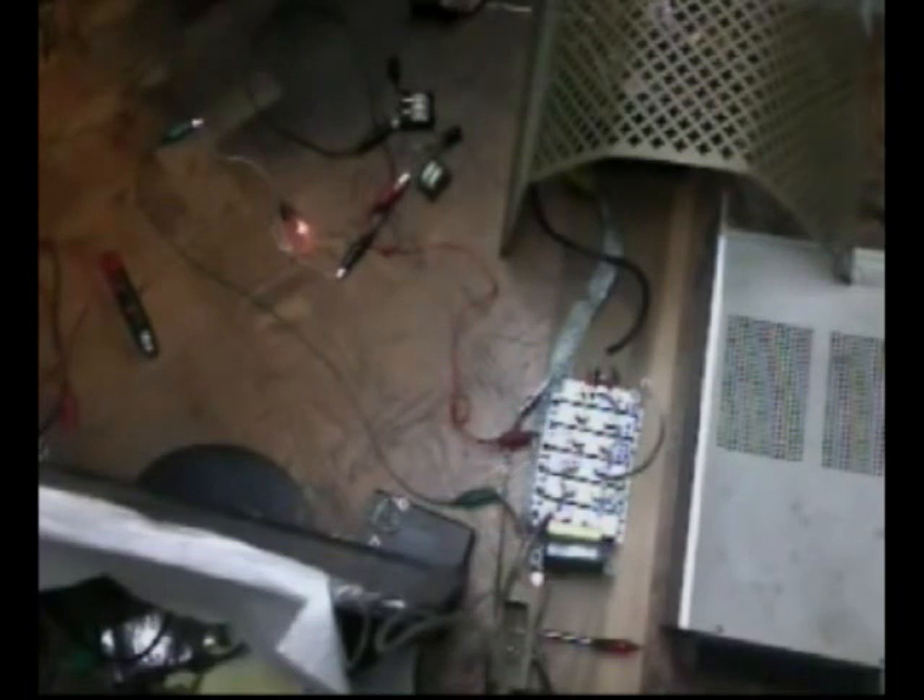I don't know, in between flashes here. I can't imagine how it could build up and not flash, or build up and go through the spark gap and flash at the same time. Maybe there's a resonance trick in there. I put a 10 ohm load across it and came up with 10 ohms across the caps. I end up with 106 millivolts at 17 kilohertz AC. DC measures 70 millivolts. Now that's with a 12 volt, 2 amp input into the globe.